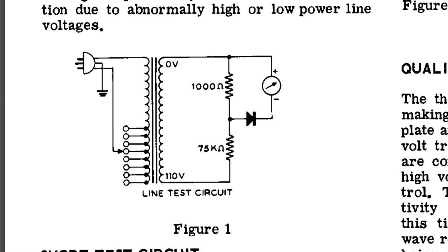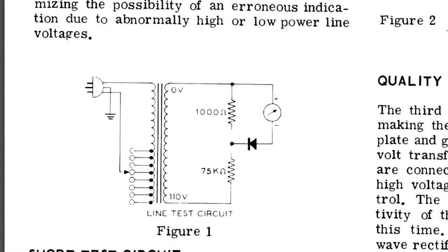Please notice that the schematics of the Heathkit tube testers of the 50s contain a common wrong representation of the selenium rectifier. It appears reversed and only with the model IT-3117 this typo has been corrected.